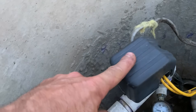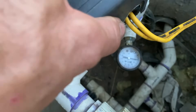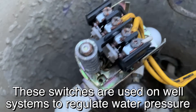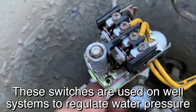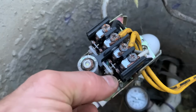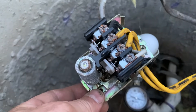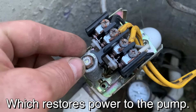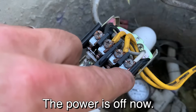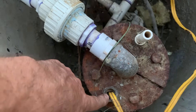The pressure switch is not cutting off and I'm kind of lucky to have discovered that. So I turned the power off and opened up the pressure switch. When there's enough pressure in the pipe it causes this to come up and it disconnects all those electrical contacts. And then when there's not enough pressure it goes back down and those connect and that sends power down to the well pump.